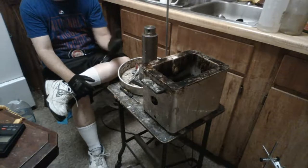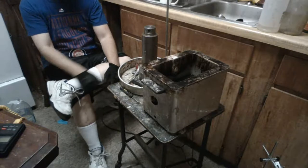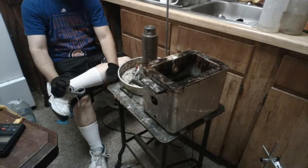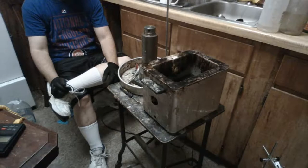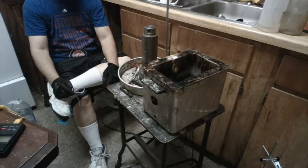At least we know that it's not bound on the mandrel. That's the main thing. Our first one might not have the best spirals in the world, but as I said, original blanks, the idea of it is to increase the time that it can be in the mold and increase the window of opportunity. Believe it or not, with a smoothbore mold, you have maybe a minute of grace at the most.